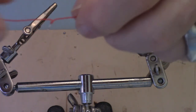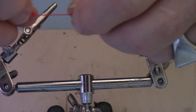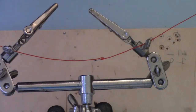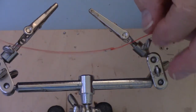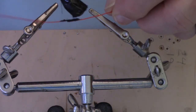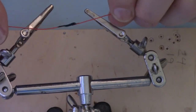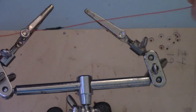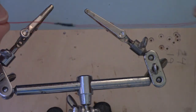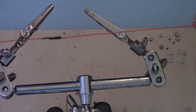It's not going to come apart. The problem with doing it that way is you've got that tail, and you might want to bend it over to one side. What I'm going to come back with is our liquid tape — I prefer liquid tape over shrink tube. The biggest reason is that every time I try to put wire on, I forget to put the shrink tube on first. You can go across here with the liquid tape, run a coating across that, and it's good and smooth. It does take about ten minutes to thoroughly dry.